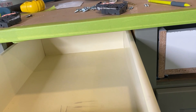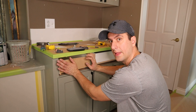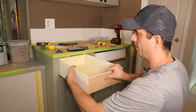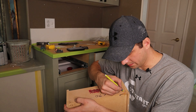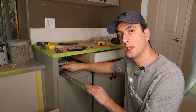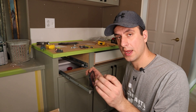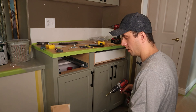Now I'm pretty happy with that — it's pretty even. I'm going to push it all the way in and lightly press on it. Here's what we get: you can barely see it, but there's an indentation in the wood. To make no mistakes, I'm going to mark it with a pencil. Now I'm going to drill a hole for the pin with the right size drill bit. It doesn't have to be exactly the same size — it can be a little bigger or smaller. The main point is to drill it right where the hook wants to be and keep your drill parallel. If it's not parallel, it won't close properly.